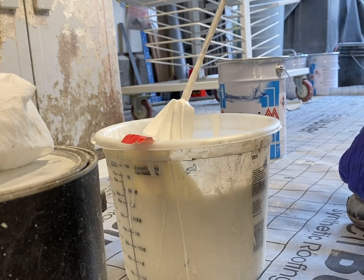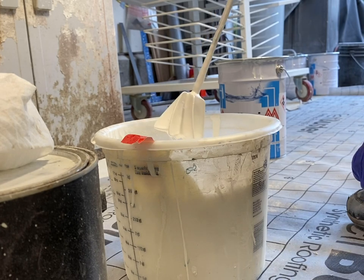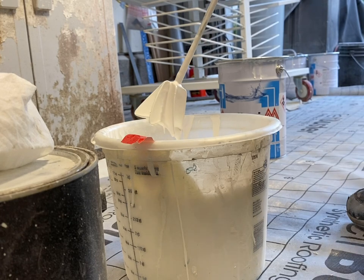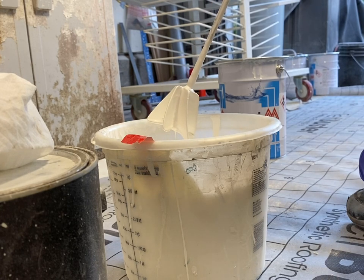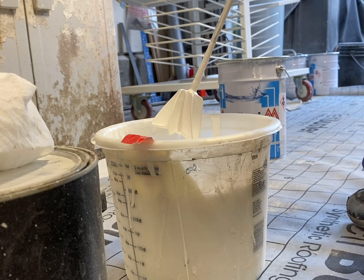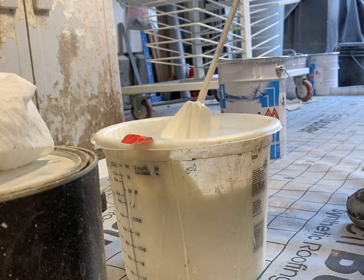If I'm spraying a door where bridging is not an issue and I'm spraying with an airless, there's no need to thin at all - actually, it's better not to thin. You can put a nice heavy coat with the right wet mils, about four to five wet mils on a door. In this case, I'm only going to shoot probably about three wet mils - a thinner product, just where it flows out nice, and bridging will not be an issue.